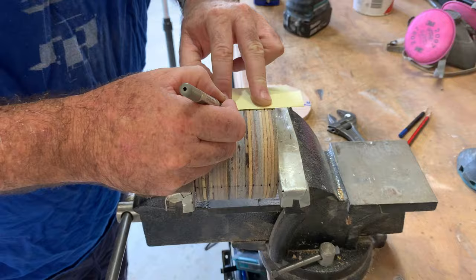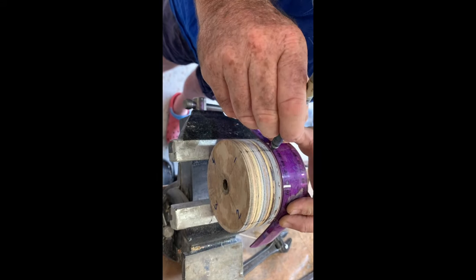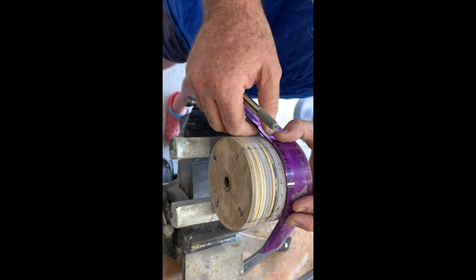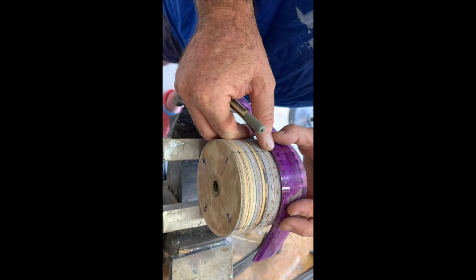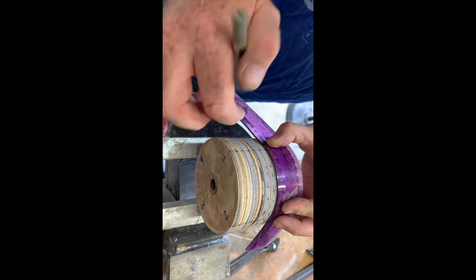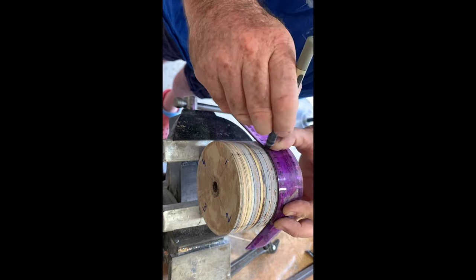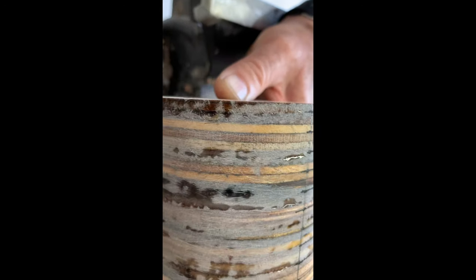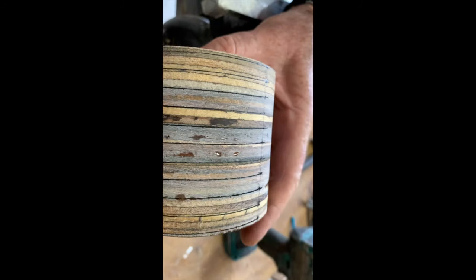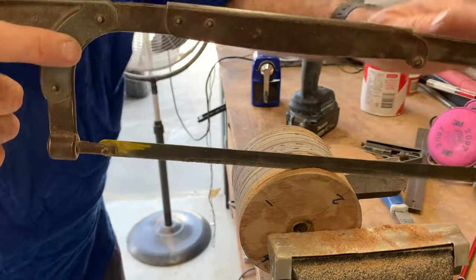We had to figure out just how much rope we could get onto this cable drum, and we had to mark off pitch and the lead just so that the whole thing followed a consistent helical angle, so that the lines stay behind on the crests. Starting to cut the screw thread.